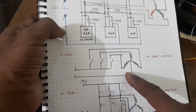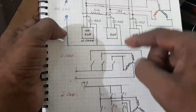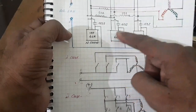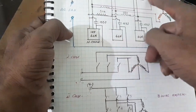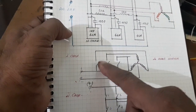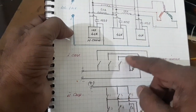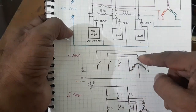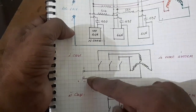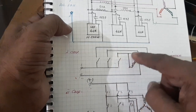What is the 4-wire system? The 4-wire system has a semi-bridge - that means only the 3 bottom 44N MOSFETs are used. The top set is in idle condition. When RYB is actuated one by one, the current passes through the R phase and returns through the negative side. If you remove the neutral for the semi-bridge, the motor is not working.